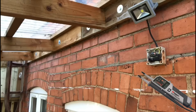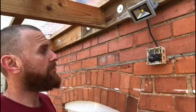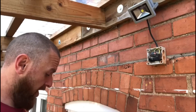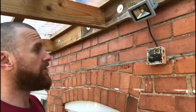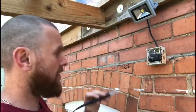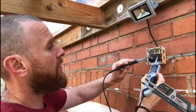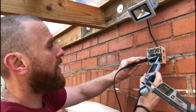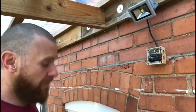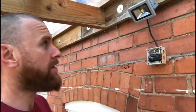We've turned off the circuit breaker and you can see the light has gone off. Now, just to double check, I'll take my voltage indicators and check. We've got the neutral and the line — no voltage appearing. I'll just check between the earth and the line — again nothing — and nothing between the earth and the neutral. I now check these against my proving unit and that's all okay. I've got my locking off kit here, so I'll go and lock off the circuit breaker.